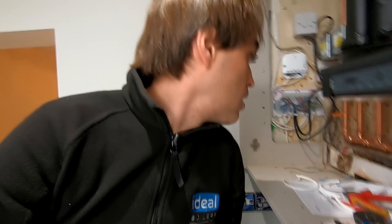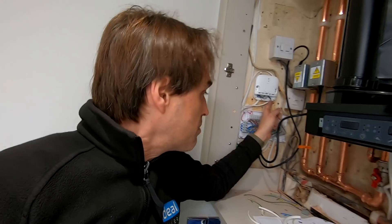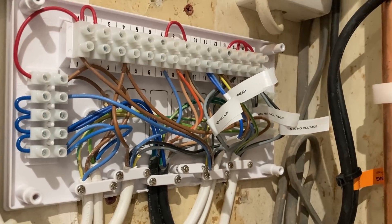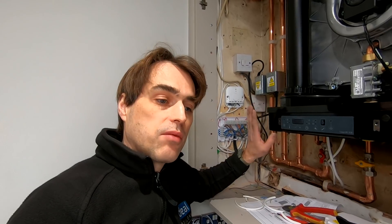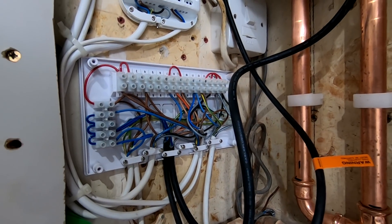My wiring's done, and to be honest it does look a bit complicated. So from the Nest, OpenTherm goes to the wiring center and from the wiring center to the boiler. I'm going to mark it so no one blows the board. Then NTC goes to wiring center and back to the boiler, and is wired in parallel with the come on and off on the hot water of the Nest. So when hot water is off, it closes the connection and also closes the NTC connection on the boiler, and the boiler thinks the water is satisfied. Some people say a 4-pipe setup on Viessmann/Worcester Bosch is simpler when it comes to wiring — and looking at it, they may have a point.